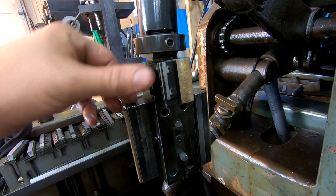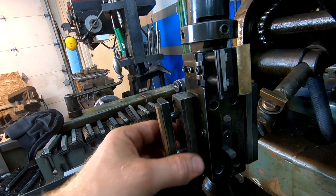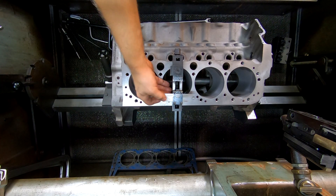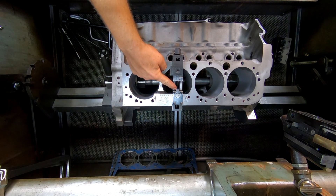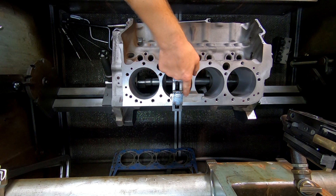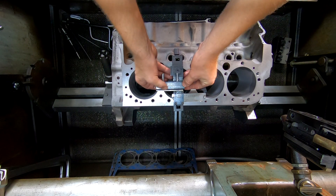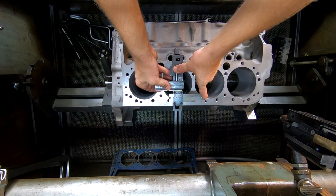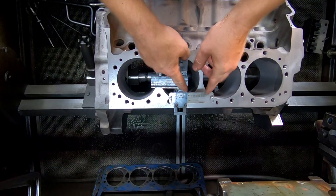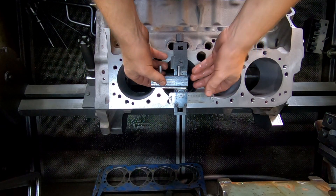What this is for is to adjust the guides on the honing head. These have various shims behind them and we use this tool to decide which shims we need. There's a slide — when you activate it, a pin slides in and out in correspondence with it, and we have a bunch of graduations from 0 to 20. We take our guides, fit them in there, and slide until it pinches tightest. This number tells us what shim stock we need to get to our desired number.